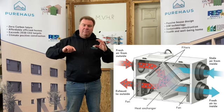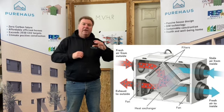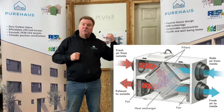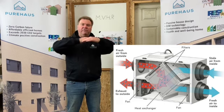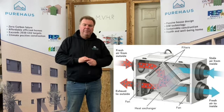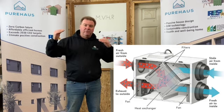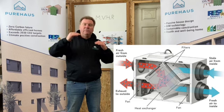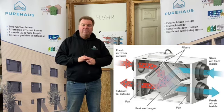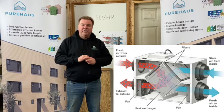The other motor brings the air from the inside, crosses through the heat exchanger and exits or exhausts to the outside of the house. So we've got a crossover of air and a continuous flow. Both filters work in both directions, because from the house we want to take dust, damp, everything that's in the house outside, but we don't want to pass it through the heat exchanger. So therefore we have two filters, two motors, one heat exchanger — and that is basically it.